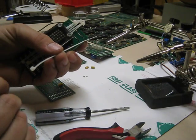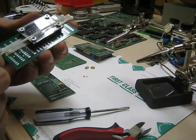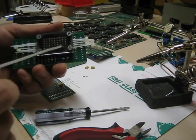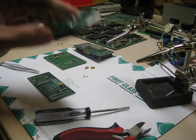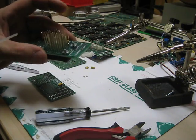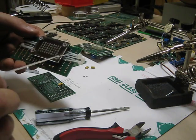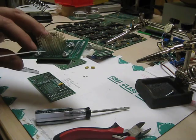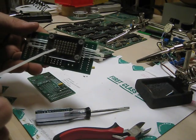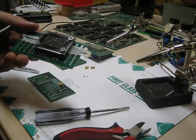These little clear white plastic zip ties from Radio Shack are just thick enough to slide right down the middle of the LEDs between the board and the display face. With some screws I picked up at a hardware store, I bolted them in place — you can notice they don't move. So now if I go through and clip all these leads off and solder them in place, they're all exactly the same space away. The problem before was that when you solder one LED and pull your soldering iron away, it tends to pull the LED with it, sucking it up inside the display so it's not flush anymore, and you end up with uneven LEDs.